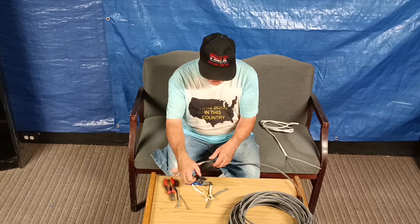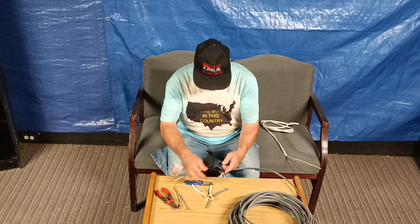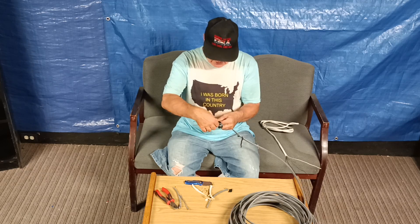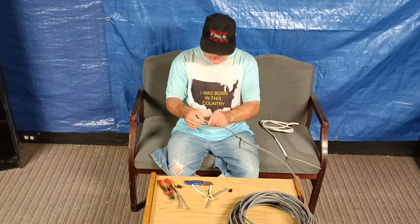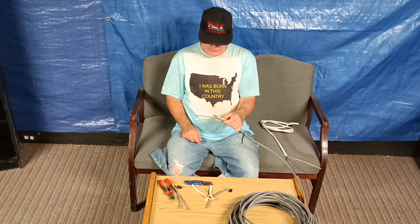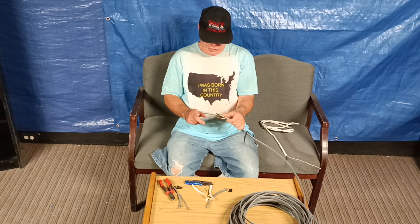In that case you remark it with electrical tape to indicate it is live — you'd take your black tape, go back a little bit and just wrap it around and identify it as live. That's how you mark it as a live wire with some black or red tape. You do that on a 220/240 volt circuit like a heater circuit, or on a 110/120 volt circuit in a switch loop where the switch is after the light. The power goes to the light first and goes down to the switch. You put the black feed wire to the white switch wire — the white wire will be constantly live at the switch, and when you turn the switch on, the black will be live up at the light.